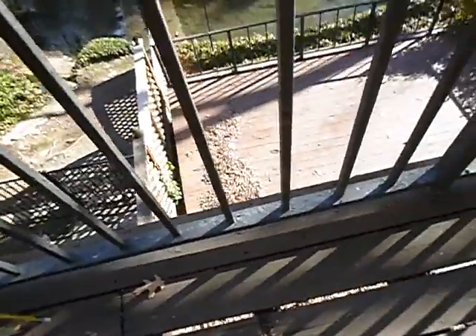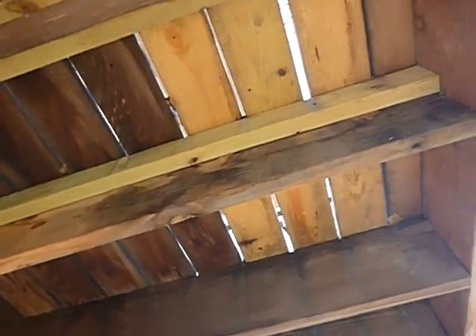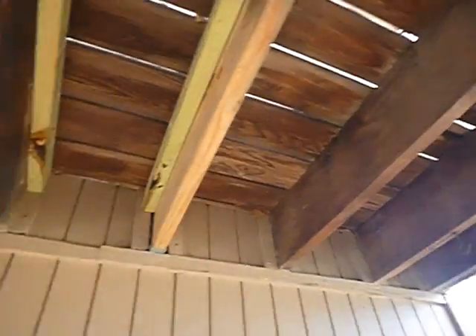Again, spaced too far apart. Got a little bit of wood rot right in there on the rail. That's 36 inches — okay, that's good. Still no flashing. We've scabbed on a board up here — we got new timbers and scabbed on a board. I wonder why all that wood rot happened. That's where the flashing isn't.